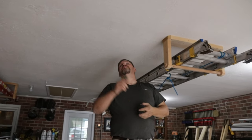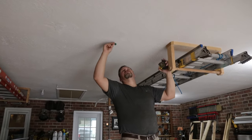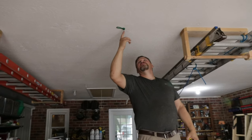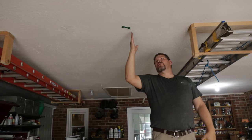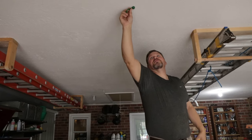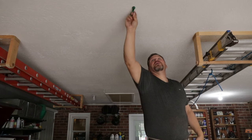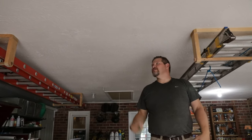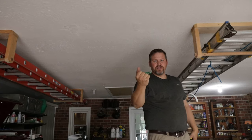Let me just come over here. It's roughly 24 inches over here, so I should hit a — right there. We got a drywall screw right there, so I know the bottom of our truss is right there. There's another one. It won't take very long to identify where a truss is, and do the same over there with a simple magnet.